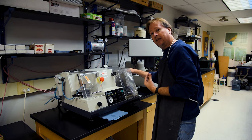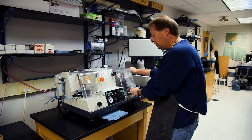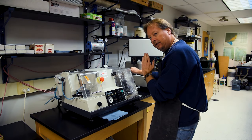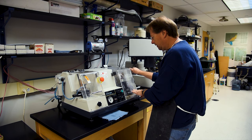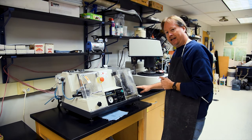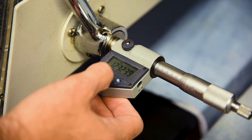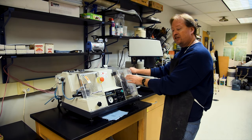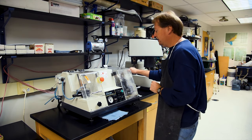I'll continue this process until I've frosted the entire surface of the slide. We'll occasionally have to take it off the vacuum chuck to check whether we've frosted the entire surface. Over time, you'll feel less and less resistance, and that's usually a good sign that you're grinding off and flattening the slide and getting it frosted. Before I pull it off, I want to set my micrometer and zero it out — this is my zero point. This is now set for these frosted slides so that when I return to them later, I can use this as a guide to determine how close I'm getting to my final thin section.